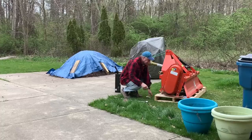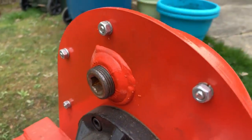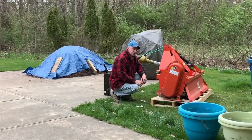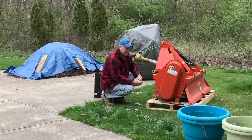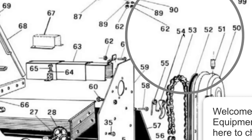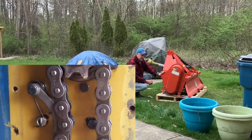There's definitely something wrong with the tiller. From what I could tell with a self-diagnosis — if I take off the oil fill cap, I can peek in there with a flashlight. It looks like the chain is still hooked up, but it's still slipping. Sometimes it works when I put it down into the dirt, then it stops. So it's telling me that the tension on the chain is not tight enough. There is, I believe, a chain tensioner in here, and a lot of times I see that the spring breaks on them. It's something I really don't want to deal with right now — this is all full of grease.